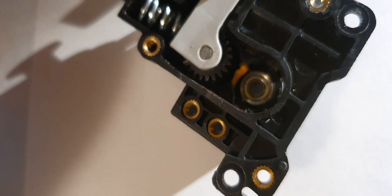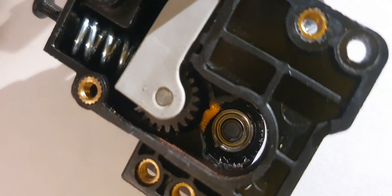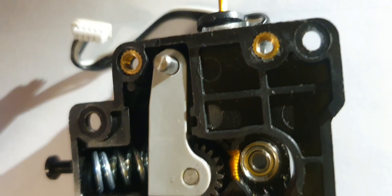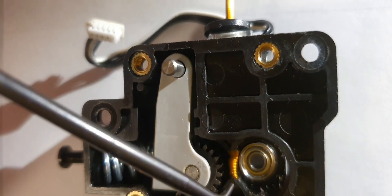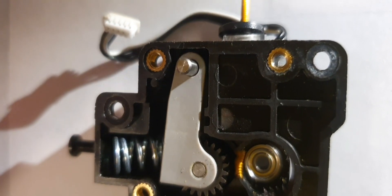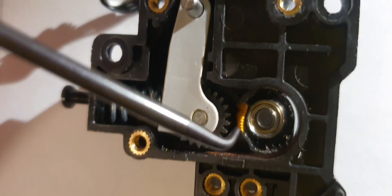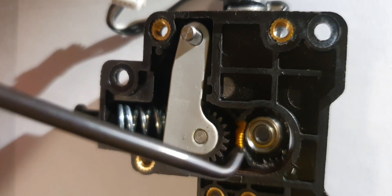I hope you can take this to heart because I know for sure I'm not the only one who has had this problem. I do believe this is not a problem with the filament being wet — I believe this is a problem with the design of the extruder. Because you cannot pull the filament upwards now, and the hole at the top is the same size, you can only pull the filament up to the nozzle tip where it becomes too big to get pulled out. So it keeps pulling it up and it fails, tries pushing it down and that fails, and every time it does that it bends and creates more bend in the filament.